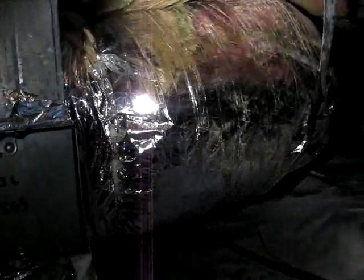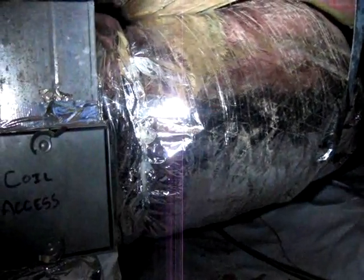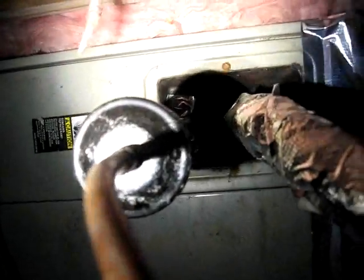Let me crawl across the lake here and get to the air handler. There's a coil access where I changed the return duct last year — ran a new return duct all the way up to the plenum and lined the plenum upstairs in metal, because there was a lot of leakage on the return side with a lot of dirt. I put this access door in so I can check the coil every year. This evaporator is almost toast — it's just falling apart — so we're seeing how long we can keep it in operation.